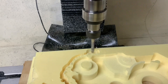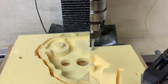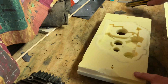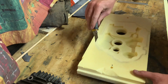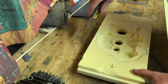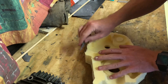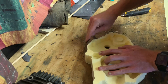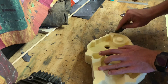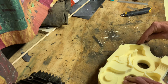Here is the final contour, cutting the outside shape of the pattern. Once the final operation is finished, I remove the material from the milling machine and take it over to my workbench to cut away the tiny sliver of material connecting the pattern to the rest of the stock. All that's left is to take a coarse piece of sandpaper to the outside of the pattern to smooth off where the tabs were and get rid of all the fluffiness at the bottom of the contour. Prior to casting, I'll coat the pattern in a thin layer of plaster and add the sprue.